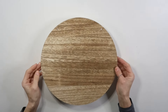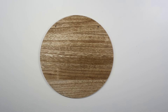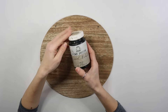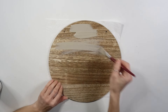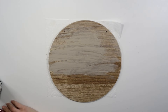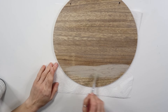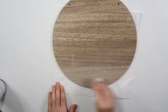This wood round already has a wood grain, but the color really doesn't fit our aesthetics, so I decided to go ahead and stain it with this wood tint. I added just a light coat of the wood tint, then used a paper towel and wiped it right off, so it just lightened the whole color and gave it a cooler-tone undertone.